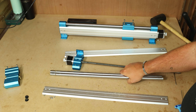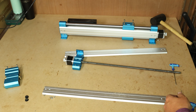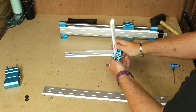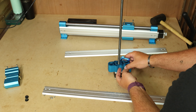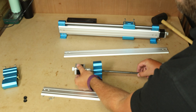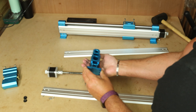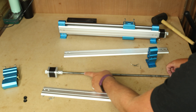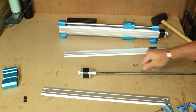There are rubber bungs on the other end of this one, so it may be easier to take those off before sliding the bars out. Sadly these bars are glued in as well — hammer to the rescue again. These can technically be discarded, but they're pretty decent bars so don't throw them away. Next, detach the stepper motor — there are four bolts in there to undo. Once you've released them and taken them out, you gain access to the coupler holding the lead screw in place.